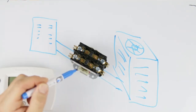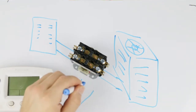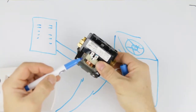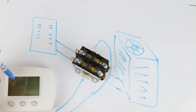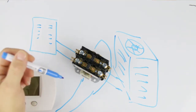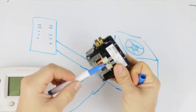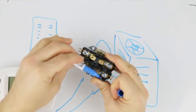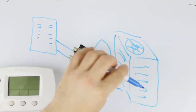The thermostat sends a signal to the contactor to turn on and off. One wire comes to one side and another one comes to the other side, so whenever the thermostat calls for cooling the contactor engages and clicks. A little magnet on the bottom engages and pulls that jumper over so that the juice flows from one side to another and continues over to the condenser.